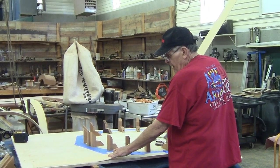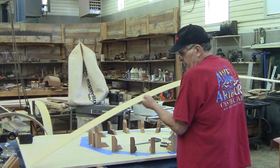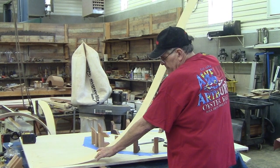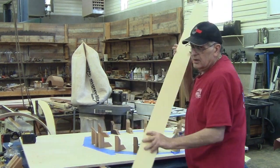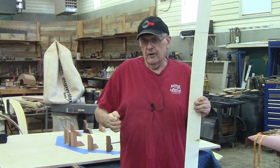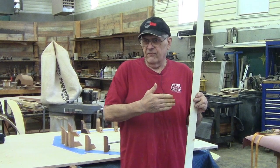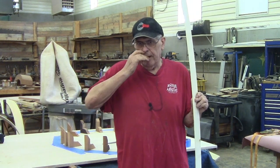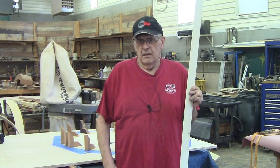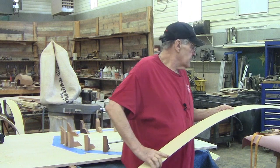it down. And then as it goes through and when it comes out, you do the exact same thing. You keep the pressure, get it up so that the pressure's pushing down on the end. Otherwise, when it exits the infeed roller, the first one, and you got all this flex and it's hanging over the edge of the planer, it tries to kick it up and man, it'll just blow the ends completely out. Always hold up in and out.